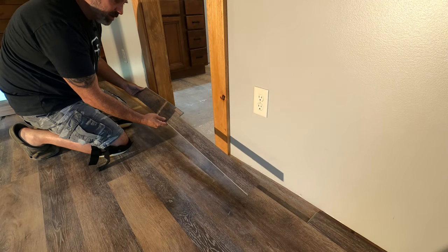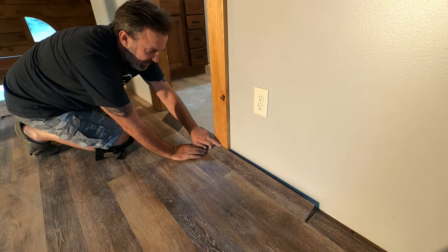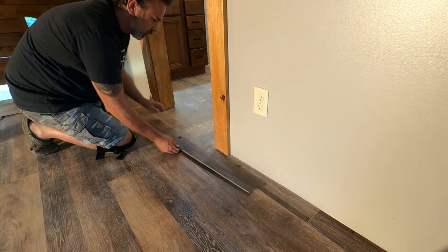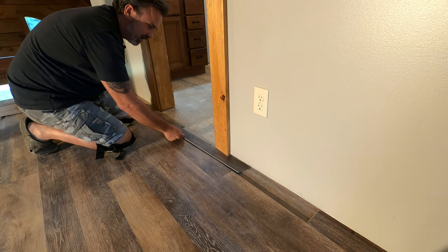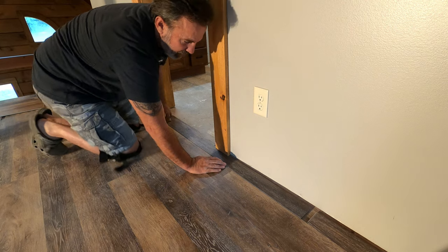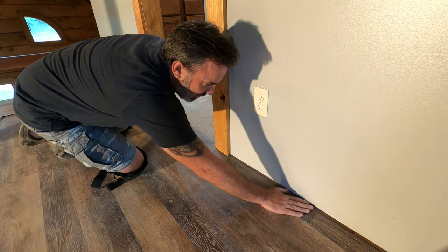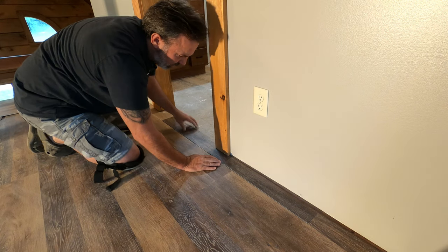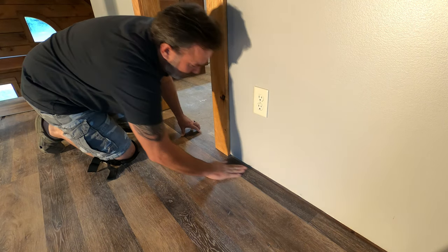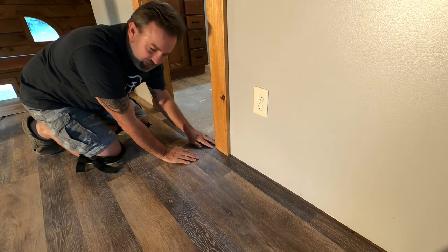Got our board we cut out, and then what we gotta do, we can't drop and lock because it can't get under here, right? So that's not gonna work. Our normal drop and lock is not gonna work. So what we have to do is improvise. We've got to go under, okay? We go under the facing, go all the way down to the edge, lift up on the end and drop it in the groove there, okay? So we got it dropped in there and we're queued up there. And I gotta lift up and drop it in there. Once everything's dropped in, you can see we are completely sealed up around our door facing here.